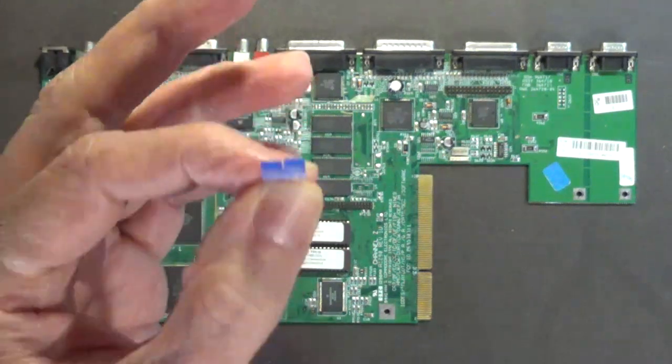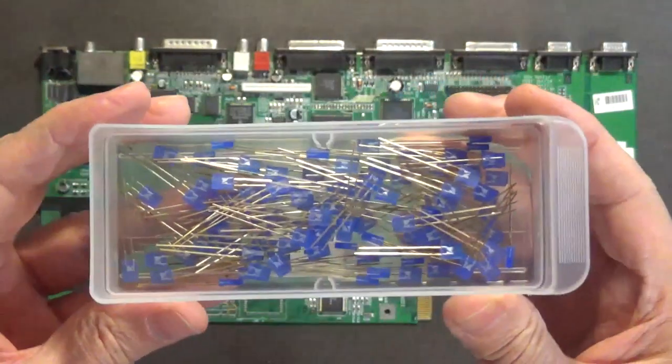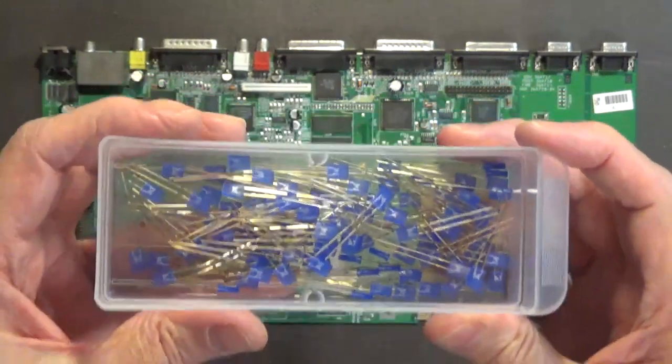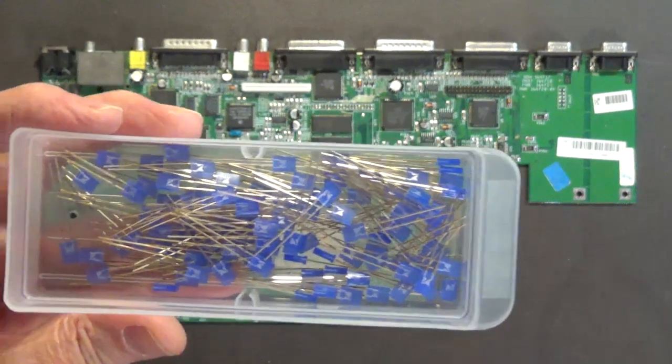And then if I change out the resistor, because normally on your green, yellow, and red LEDs, you can get away with using either a 330 ohm resistor or a 470 ohm resistor. That's too low for blue LEDs. The blue LEDs will shine very bright. And bright blue light is actually bad for human health. So when you're using these blue LEDs like this, or even the normal round ones like the 3mm or the 5mm blues, anytime you're using the blue LEDs, you really need to tone down the brightness.